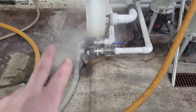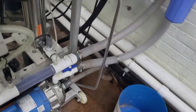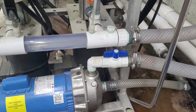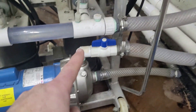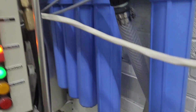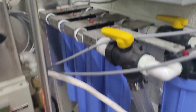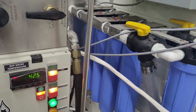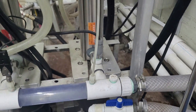Freddy and Oscar and the raw sap all feed into the inlet of this feed pump. This blue centrifugal pump pushes the raw sap through these filters — about one micron, very similar to what you'd buy at Home Depot or Lowe's, just a larger, longer canister. The entire job of that pump is to feed the pressure pumps.